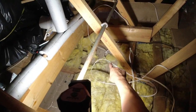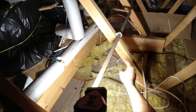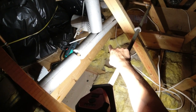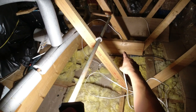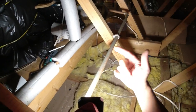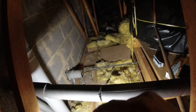James is just checking the original fan isolator cable, make sure it's okay, we can reuse it. That will then run into the box here, give us a permanent feed and a neutral and an earth down to the fan isolator. We'll then have to use the existing, what they did was wire a 3-core. What do they use, James? The brown is the feed, and they switched on black and grey. Yeah. So that's the two switch lines. So we'll say black will do the fan and the three lights in the middle, and then the grey will do the one light over the sink.